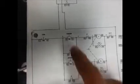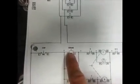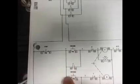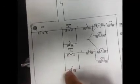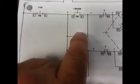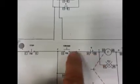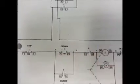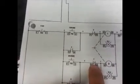The best way to wire this is to start from the feed of one of the lines and go to your stop button. From your stop button you will go to the reverse button, pick up the other side of the forward button, and then pick up both sides of the normally open contacts of that circuit. What you need to notice is that these contacts are forward and reverse, and that the forward close contact is in series with the reversing start button, and the reversing close contact is in series with the forward start button. So you have two normally open and two normally closed contacts located on your contactor.